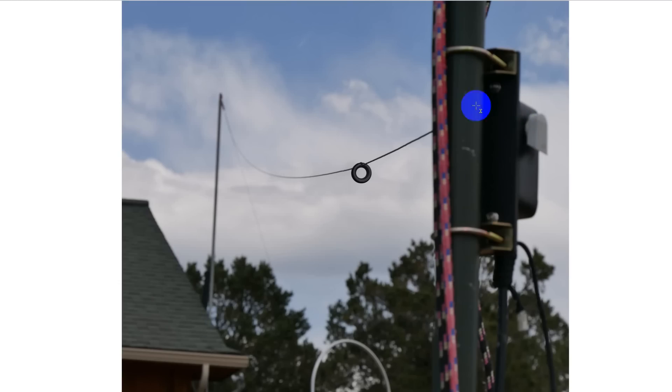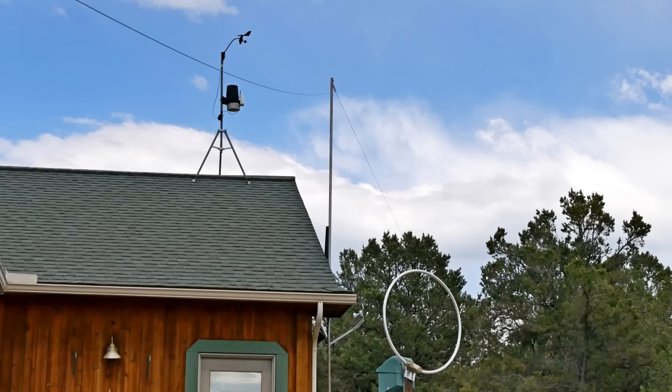This is what it looks like going up to the center point. The center point is right next to the house, which is on a little rise, so relative to the pole this is more than 20 feet of effective height. This is the little coil shown in the initial picture — it helps settle everything out and get the SWR in the right place for the right bands. This is in an inverted V configuration, as you can see. I just leaned the two top rail pieces up against the house, and there's a screw there to hold it in place. This will hold just fine.